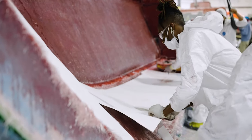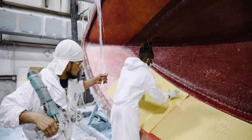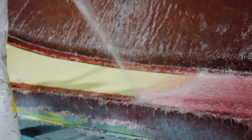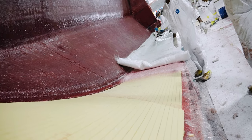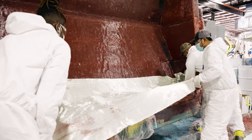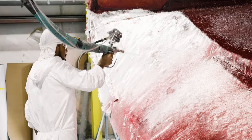Once the putty is in place, we add many different types of composite materials with different purposes, ranging from screw retention all the way to sound dampening. First, the hull sides receive a full layer of coring — a material that is great for its sound dampening and rigidity properties. To finish off the lamination process, we hand-lay bulk fiberglass to the specified density, ensuring proper thickness across the entire hull.